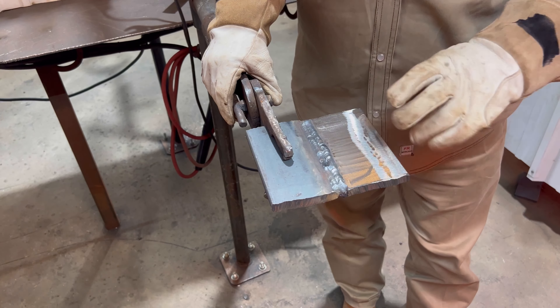This right here is your wire wheel — it's used to clean the surface of your weld. The grinding disc is used to grind down your weld, plate, or pipe. The correct way to put either one on is always with the nut facing toward the grinder. You don't want to put the grinding disc on with the nut facing out. Make sure it's disconnected before working on it — you don't want to accidentally press that button. Press the lock button and snug it up, because if you don't snug it up the motor and disc will just snap and lock together.